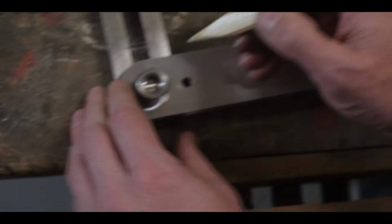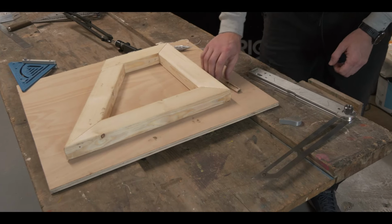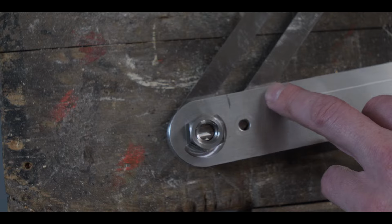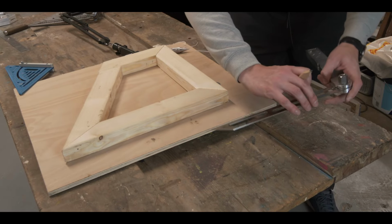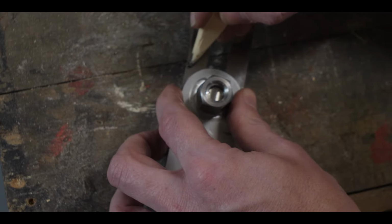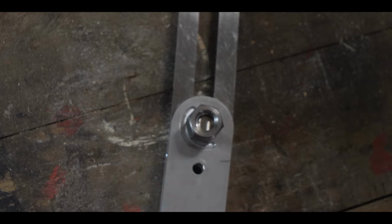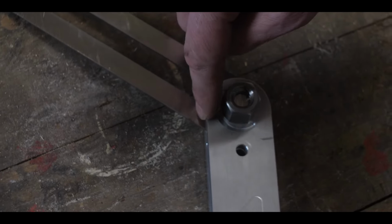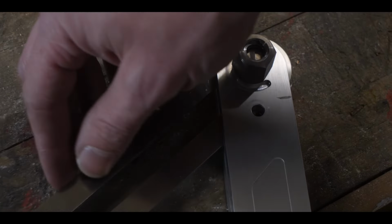Here's the problem with your ruler. If you have your 0 here, can you see that pencil mark? Yeah, I can see that. Right, then if you adjust it, obviously that becomes no longer useful because the start's there. Now if you did the same thing on the tongue and you had your mark, let's say on the tongue there or there, that's your ruler, right? If you do this, there you go, your 0's disappeared. Same as on the outside, can you see that? The 0 is over now, it's, what's that, 10 mil, right? Yeah. Now it's 0, but it's only 0 when it's at 90 degrees.